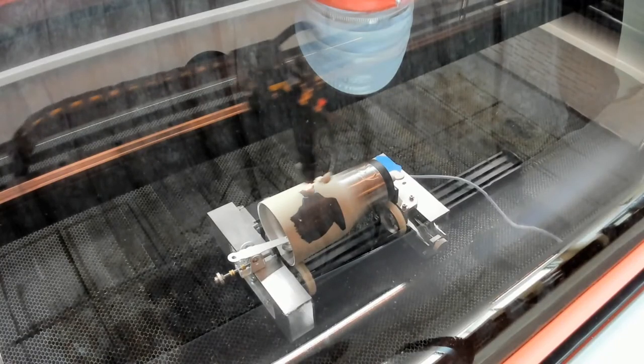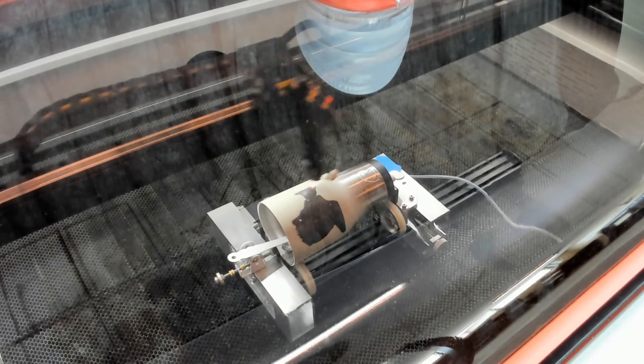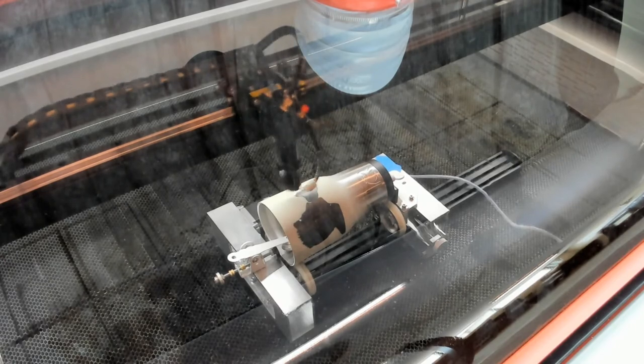I've had someone else asking about how they come out on Polar Camels. Same exact process. The tumblers may vary slightly, and I am going to have a later video on doing the powder coated ones. I thought we'd just start off with a little bit simpler thing and do the stainless steel ones here. Having somebody ask about tape, and could it be used instead of the CerMark? If you're asking about the CerMark tape, that is an option. I have had some mixed results with the different types of CerMark out there. Again, I find the LMM 6000 the most consistent, and I always have really nice results with that.